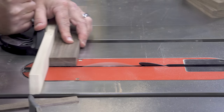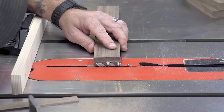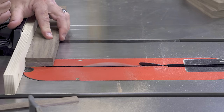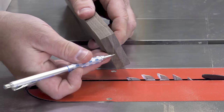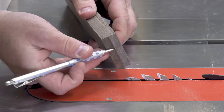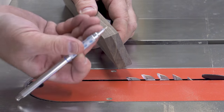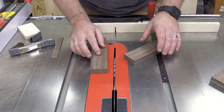Lock it down and try it one more time. Most likely I just went a little bit too tall, so I'm going to back this off just a little bit and try one last time. And that paper-thin sliver we have here — I can break that with a pencil lead, so that's really, really thin, and that's going to be just fine. Now I have the blade height locked down.